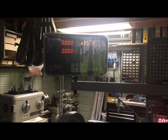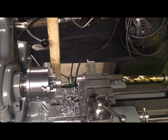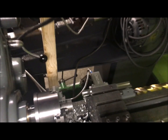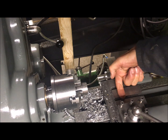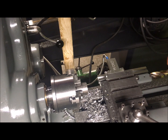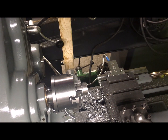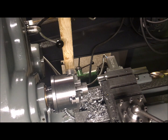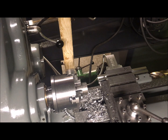I took advantage of Machine DRO's August offer on the specifically adapted Myford DRO sets. This includes a very clever design they made for the cross-feed axis — you can mount the magnetic strip underneath the cross slide, which leaves both sides free with no obstruction on either side. As you can see from the pictures, this is how I did it, following the detailed instructions given by the company.